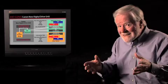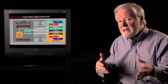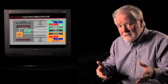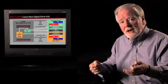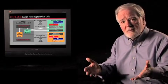But in both cases, the data — the lookup tables — are being manipulated in real time via the serial interface between the lens and the camera, when the operator moves zoom, iris, or focus.